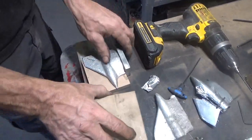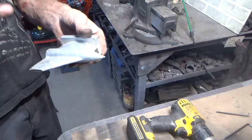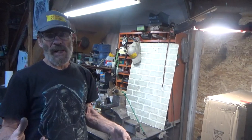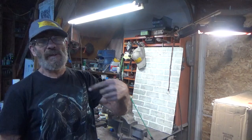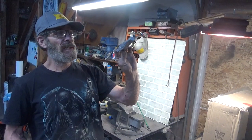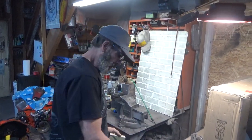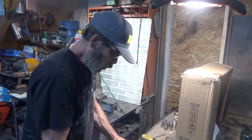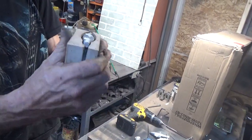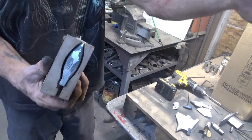And then with this one I could cast plaster casts, plaster of Paris. Once that plaster of Paris was dry, we drilled 2 holes, and basically I could pour aluminum, and voila, we come up with the lower end of the gearbox. And you could use the Bondo mold like a vise. You could literally clamp that in there and use that as your clamping device to bore out your holes in the drill press. That was kind of how I did it back in the day.